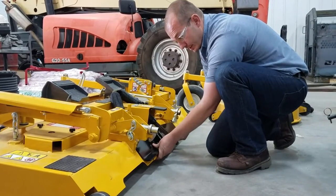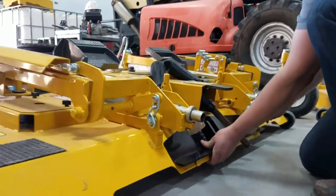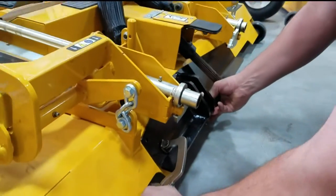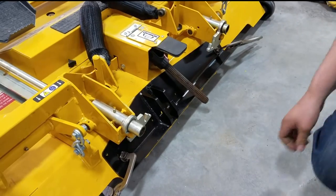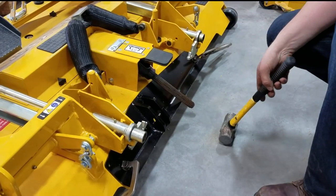The procedure is to line it up between this upright and the opposite upright. We're going to clamp it in place with some clamps. Then what you're going to do is mark your holes — I like to mark your holes with just a center punch.